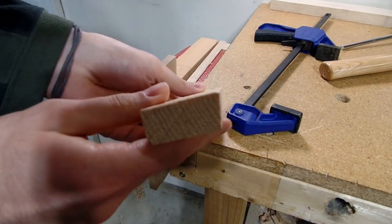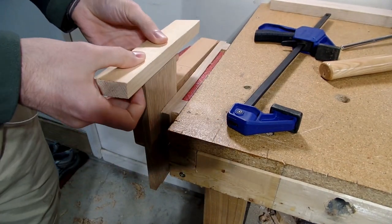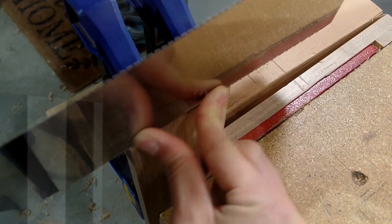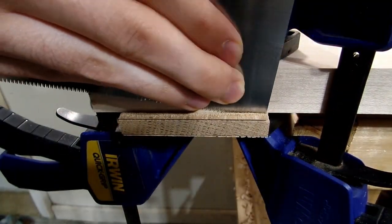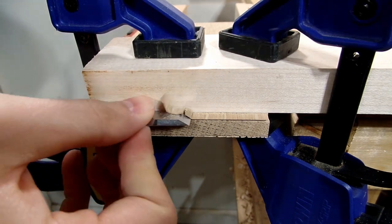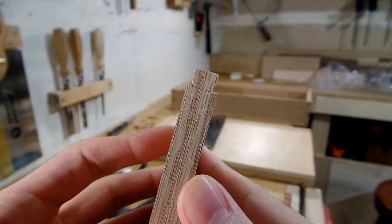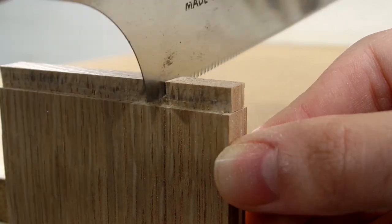On the flip side, not having the perfect tool for every job provides fun opportunities to problem solve, and cutting the sliding dovetail is a great example. There are hand planes and router bits that can make this cut a whole lot easier, but I didn't have either of those. I also could have tried making these angled cuts by hand but didn't yet really trust my skills to do so accurately. So I thought that clamping an angled block of wood and using it as a reference was a simple creative solution that made cutting a clean sliding dovetail super simple.